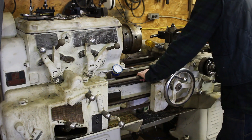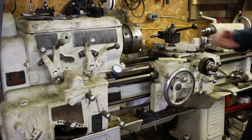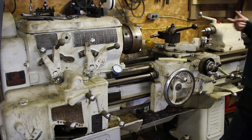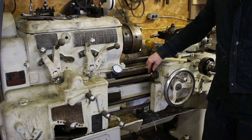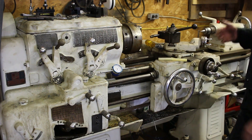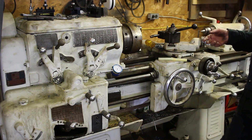That's the off position — it will disengage your cross feed. If you have this clamp down and you're feeding this way, and you hit this stop and it's clamped down well, it'll stop the feed. That's not a feature I've used much because it makes me feel a little nervous, to be honest.